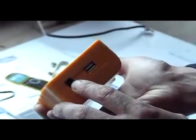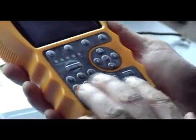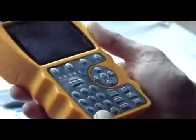Just to give you an overview of the meter itself: this is where we charge the meter — just a standard mains charger. We have a USB port here, and if we look on the top there's a nice design feature — a safety mechanism so that if you drop the meter it won't break off the F connector, which is a real problem with other satellite meters. You simply put an F-type connector on here, screw it on, and clip this back over the cable. In terms of functionality, we have a number of function buttons, a power on/off button, scroll mechanisms, menu keys, and a numeric input area.